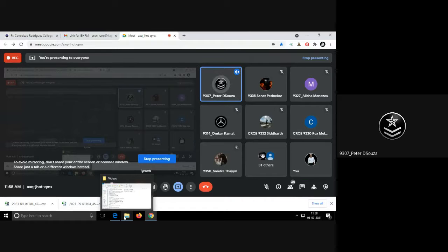Yes, sir, but at the center of the extrusion, it had a pattern, so a die cannot be at the center of the... Means how could the die be supported there? No, no. Just now you saw the die, isn't it? In the die, wherever there is a hollow portion cut in the die, there only the material will be extruded. Rest of the places it will not be extruded. So that will be a solid. That will be a hollow portion, isn't it? And the remaining portion will be solid. That is what will be extruded in the die.